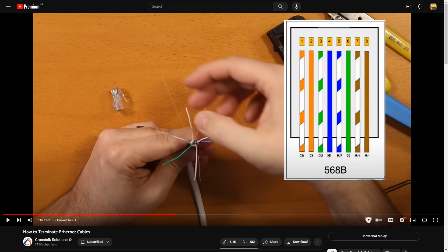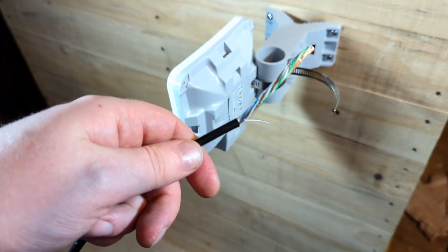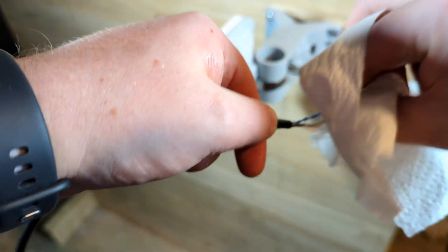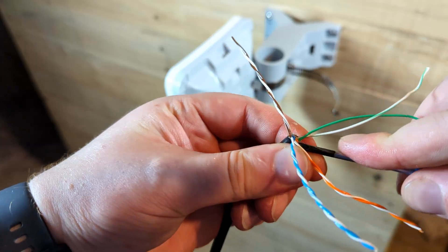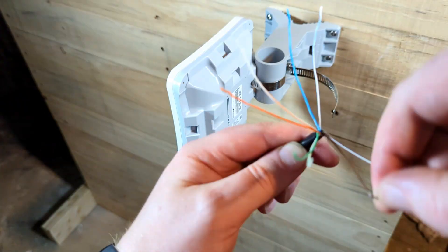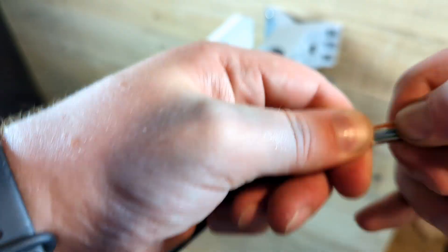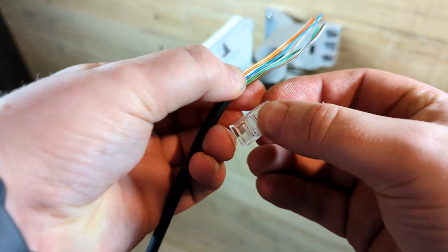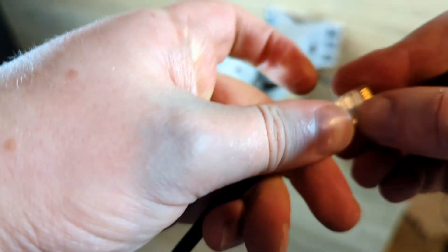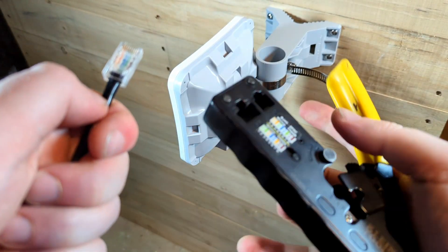You will need tools to attach your own RJ45 ends — complete kits run about $15 to $20 and making them can be tricky, but there are plenty of good YouTube tutorials. Strip off a few inches of the outer plastic without damaging the wires inside — if you don't cut all the way through, you can bend and snap it. Cut off the ripcord inside and clean off the grease. Organize the pairs into a plus pattern and use a small flat-head screwdriver to untwist the wires, arrange them to match the 568B color code. Use your thumb to keep the wires flat, shimmy them together, gauge the cut length against the connector ensuring the jacket sits under the strain relief tab, then carefully slide the wires into the connector, verify correct order, and crimp.